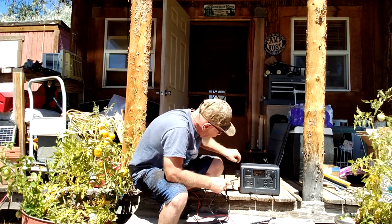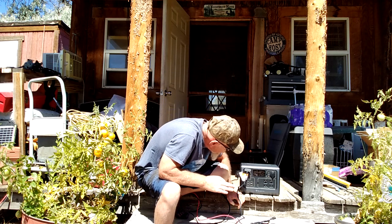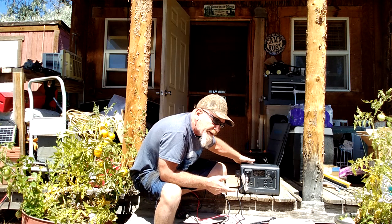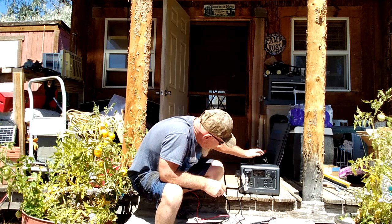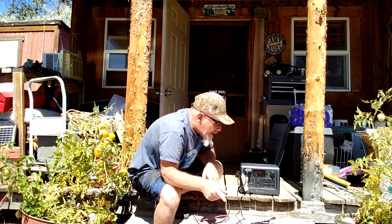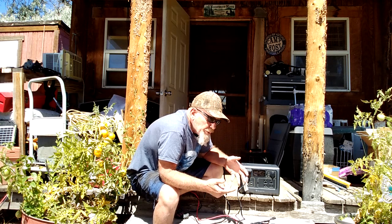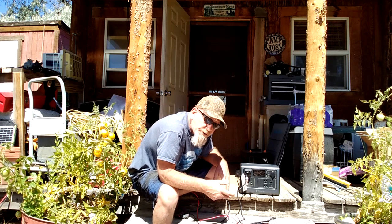These have MC4 connectors and it's really straightforward — just connect them to the correct connector. I'm unplugging the AC so we can see how much solar this puts out. With a 120 watt solar panel and really good sunshine directly above, I'm getting right around 100 watts out of the 120 watt panel. Plugging both in, the fan kicks on now to keep that MPPT controller cool, and it's pulling 303 watts total — about 103 watts from solar and 200 watts from AC. Running both together, I'd figure anywhere from two to two and a half hours to charge, versus three hours on AC alone.